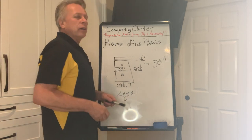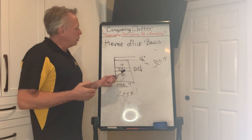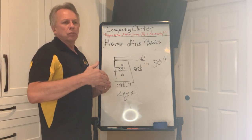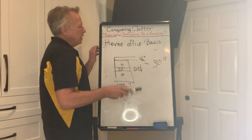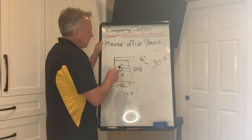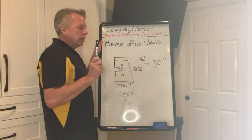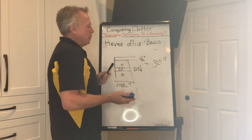Letter and legal are probably the most used file cabinets we build for an office system. All the others are dedicated to storage, pull-out printers, and things like that. Key things to remember: 30-inch countertop height; 16 inches inside or 17 and a half overall for letter; 19 and a half overall or 18 inches inside for legal. Remember those when laying out your cabinetry.